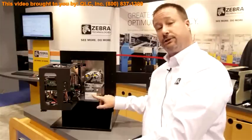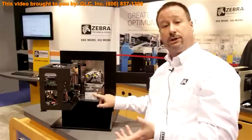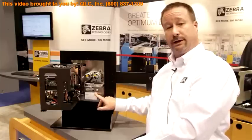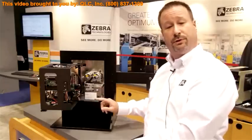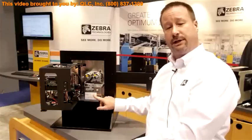This modular drive system can be removed with just three screws and used as a spare module or rebuilt on a benchtop. The belts are underneath this plate and are easily changed — what used to take a long time now takes 10 to 15 minutes. Even changing resolution in your printing device from 203 to 300 DPI or 300 to 203 can be done in just a matter of 10 to 15 minutes.